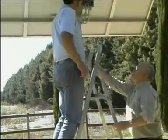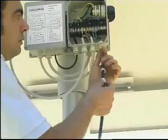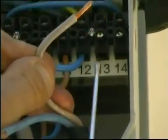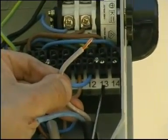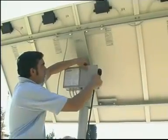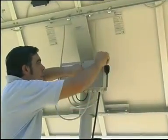The electric cable coming from the pump will enter the box through the last cable clamp to your right. As always, the brown wire will be connected to a terminal with an odd number, number 13. We now connect the last wire to the last available terminal. Terminal number 14 will take the blue wire. To avoid losing it, let's put the paper guide back inside the box, closing it well with its cover.